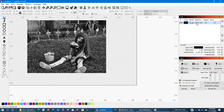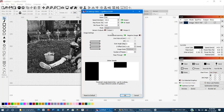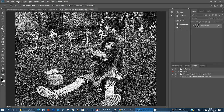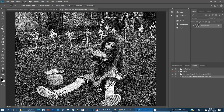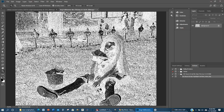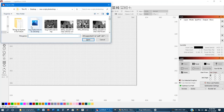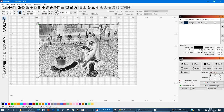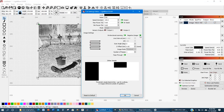In LightBurn, open up your settings. I'm going to go back and redo this save because I inverted the image back. If you were going on wood you'd leave it as-is without inverting. Since the photo is already coming in inverted, you will NOT want to activate Negative Image — if you do, it's just going to invert it back and that's not what we want. Since it is already inverted, turn off Negative Image.